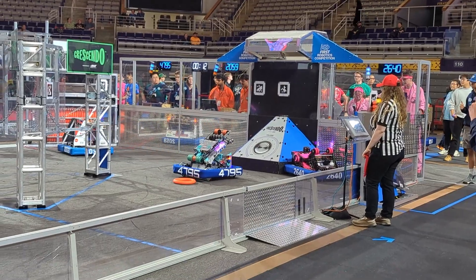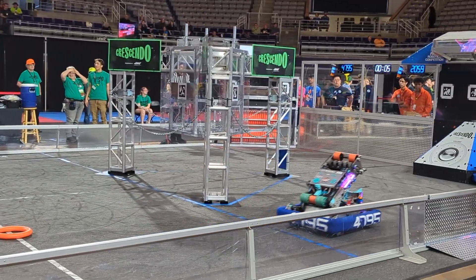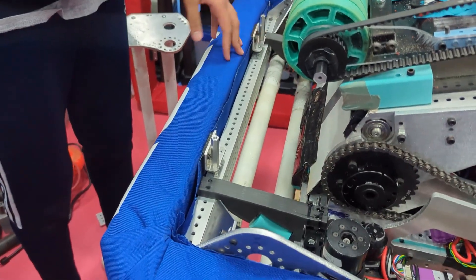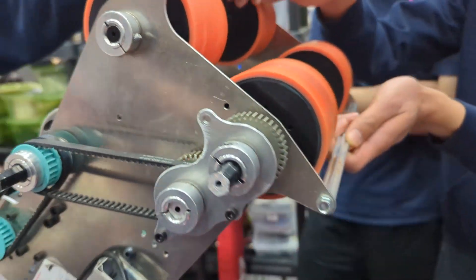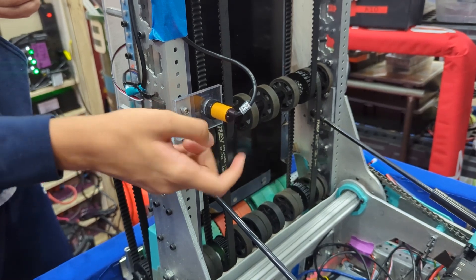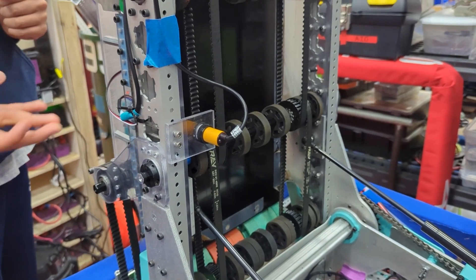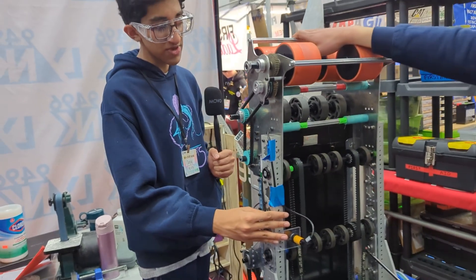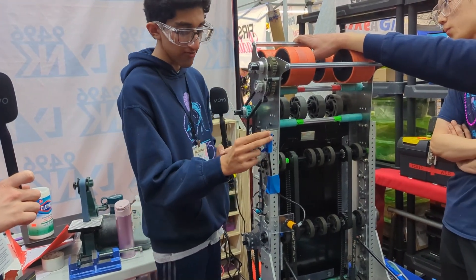Do you want to pass it over to Sanjay to talk about the sensors and controls? So for sensing the note as it goes through the various stages of our mechanism — we start at the intake, where we detect a fast intake by reading current limits of the motors, and from this we can tell if there's a note in there or not. Then it moves on to the handoff, where we have a beam break sensor right here. This will detect, just like a limit switch, yes or no — is the note in its vision. So we'll know exactly when we have a note stored inside here, meaning we won't be able to intake any more notes if we already have one, and everything will be easily automated.